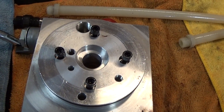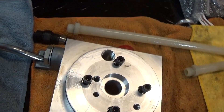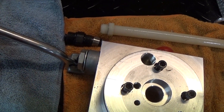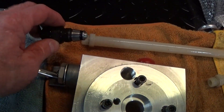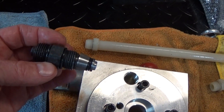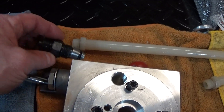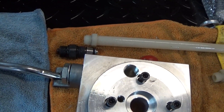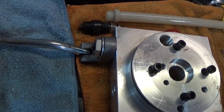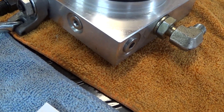On the bottom of the motor is the block that attaches to the motor and attaches to the pump. Here is your release valve — we looked at that in one of our other videos. Now if this valve gets clogged up with a piece of dirt, or if it wasn't made right, it will not seal off and the lift will start coming down as soon as you release the handle or release the button for it to go up.